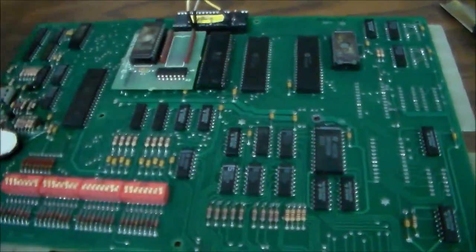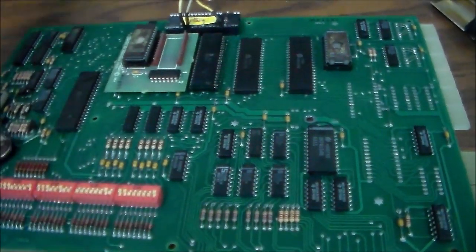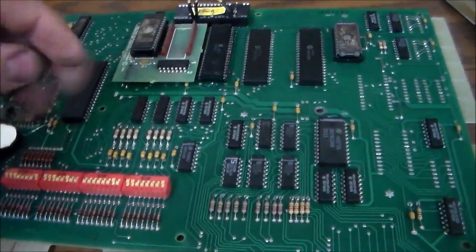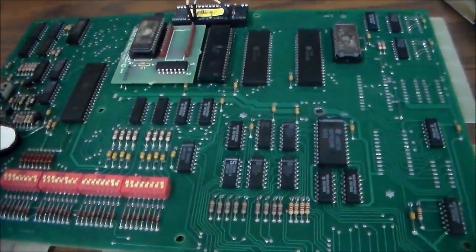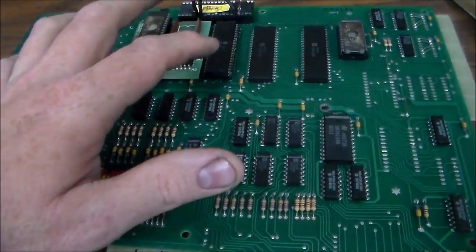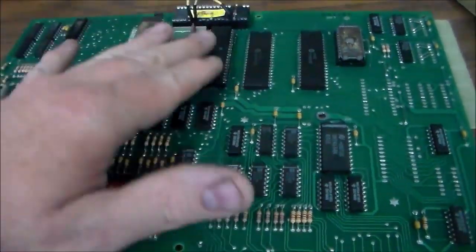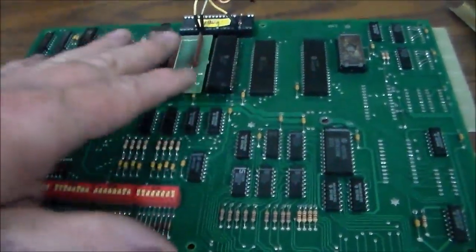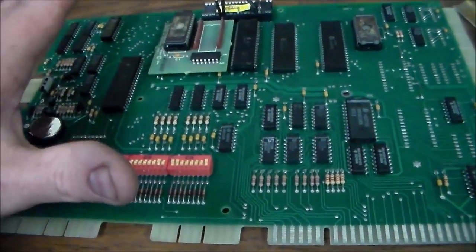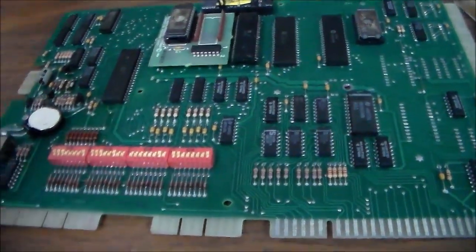So I thought, oh, that's got to be it. Now, if one of these chips goes bad, the board won't boot. So I figured the drop targets dropped, and whenever they hit the switches, it must have screwed it up. Whatever, right? So since this one was hot, I thought, man, it's pretty safe that's going to be the problem. And we've mentioned in the other videos that I haven't done the ground mods to these yet, but I don't think the ground mod not being done would cause the RIOT chip to fail. I could be wrong about that, but that's just my opinion.